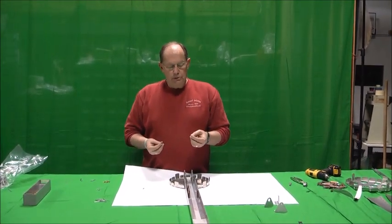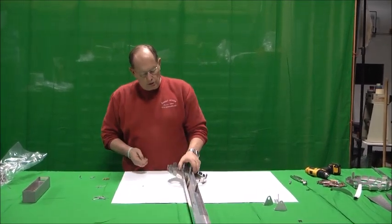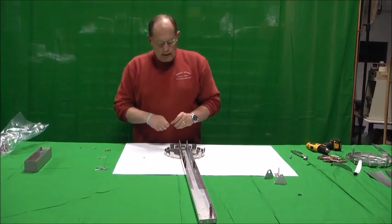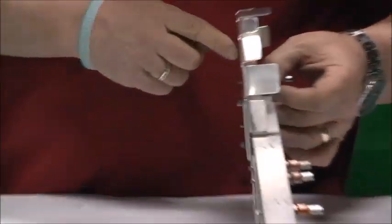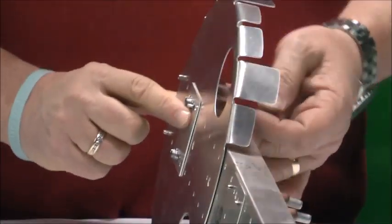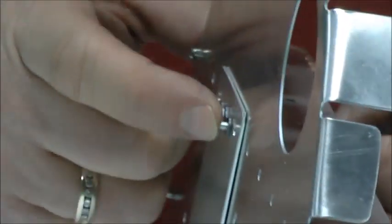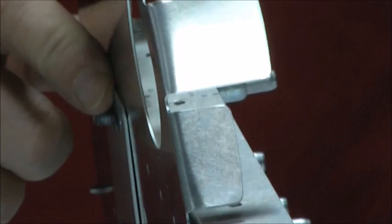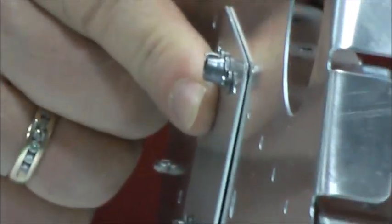The length is 2 eighths of an inch, or a quarter inch. Just be sure that when you rivet these, here where you're going through all the material, it's going to take a 34 rivet. You can see when I put this into the hole the rivet protrudes just about the right amount, and that'll make a good rivet. If I get the wrong rivet in there, I'll show you what a wrong rivet looks like so that you can identify that before you pull it. You can see it's flush — there's not enough rivet head sticking through there.